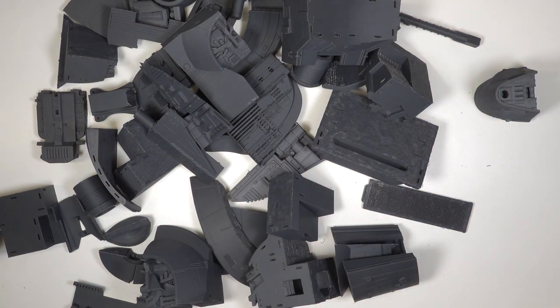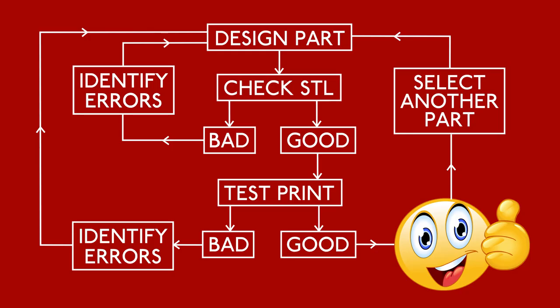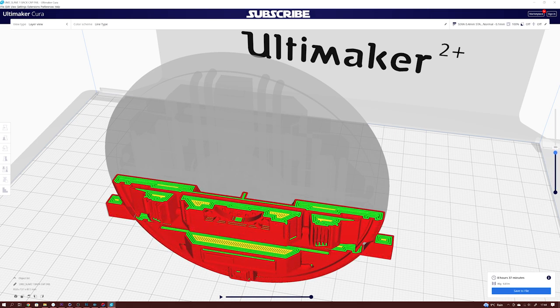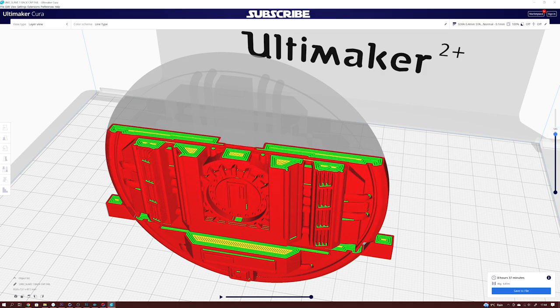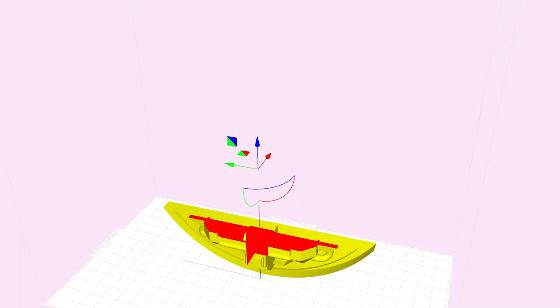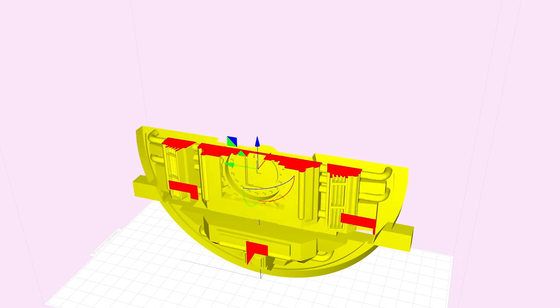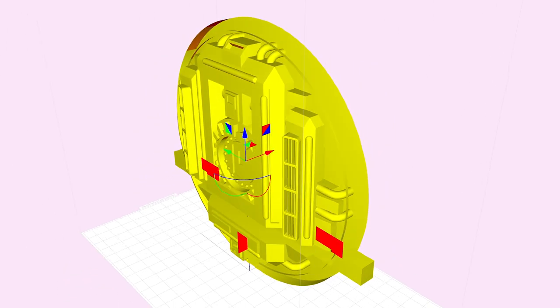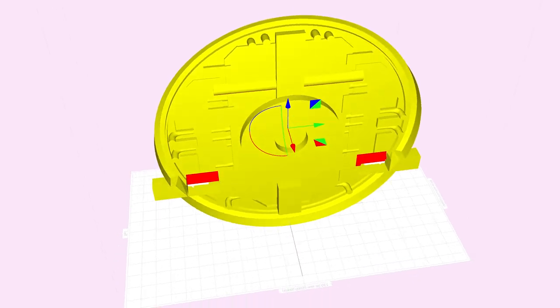With the parts broken down they now need to be debugged for printing. This is my process for preparing the parts. Basically each part is exported as an STL file, checked in three slicer programs and any errors are corrected and changes are made before a test print is made. Here's an example of a cockpit part with intentional errors in the Ultimaker slicer Cura. The backing disk and front detail should be one green slice at each level — here they're separate, which is not good. In the Photocentric slicer we get areas showing red, and when we rotate the part the back disk is transparent. This is a sign that some of the parts are inside out — their normals need to be flipped. You can see more about this in my how-to video about 3D CAD design.